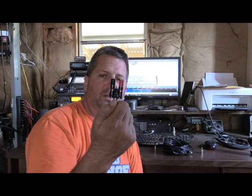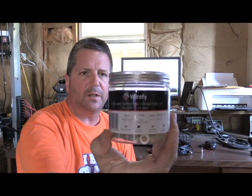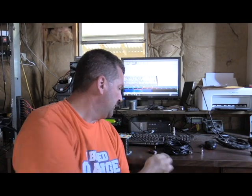The next thing you're going to need is what I commonly call the banana plug. The banana plug has a BNC male on it; one end your coax connects here, the other end connects to your radio. You're also going to need some ring terminals. I got these off Amazon — they're good, heat-shrink style for stability. They're quarter-inch ring terminals and 12-10 gauge wire goes in them. You'll use these to connect your wire to the banana plug.